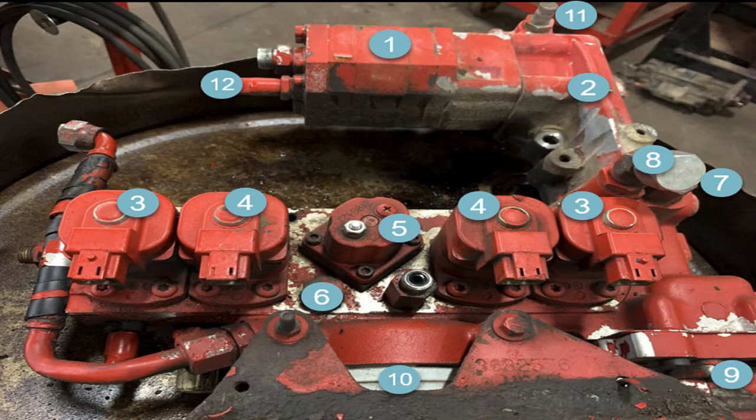Fitting 8 is return fuel out of the gear pump and the four solenoids on the front, back to the tank — that's part of the cooling process. There are two solenoid number 3s and two solenoid number 4s. Those are precision metering valves run with pulse width driven by the ECM. The solenoids number 3s are metering or fueling, and that is what the ECM uses to control the horsepower, torque, and power band of the engine.